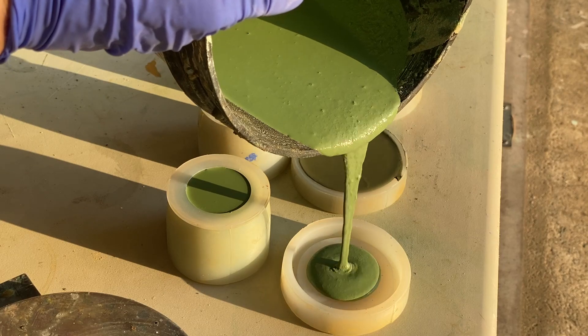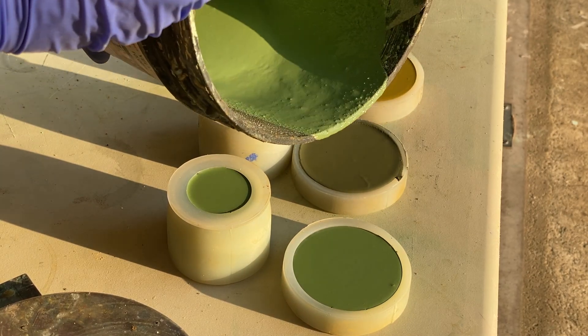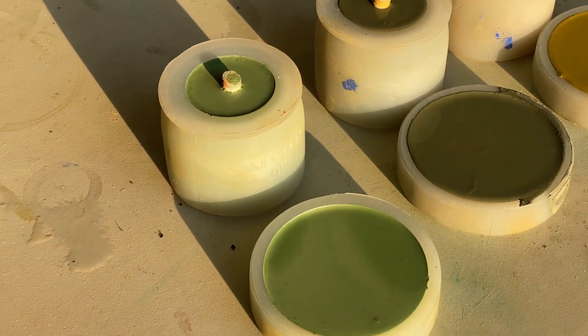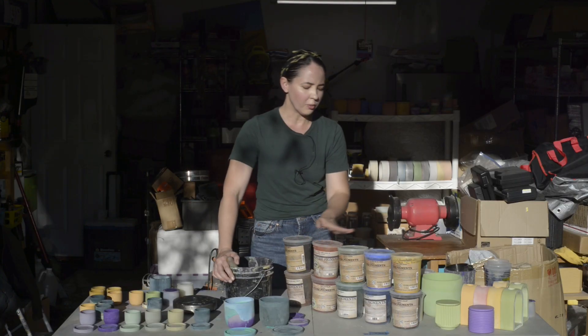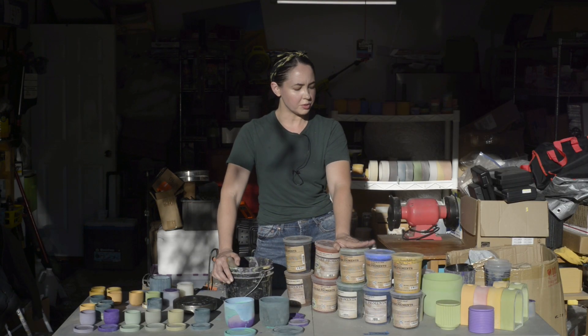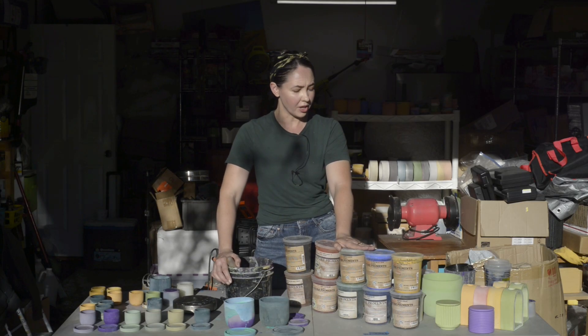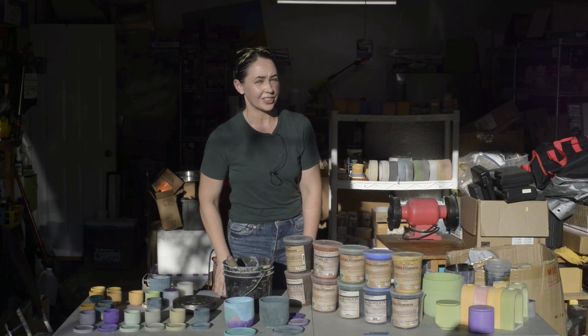And would you look at that color? Now we only added about half of the max, so we can always add a little bit more and make it more saturated and darker. But I kind of do like this light green sagey color. One thing I do like about working with oxide-based pigments is that your workflow is going to be pretty much the same as if you did not use any pigments at all — as far as setting time and workability of your concrete, you don't really have to change that much. So you might be thinking you're not too crazy about that sage green color.